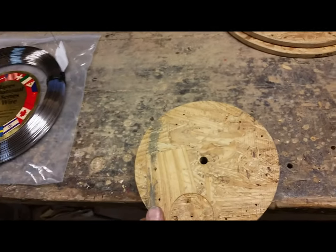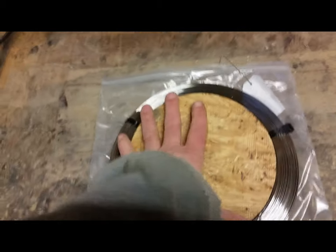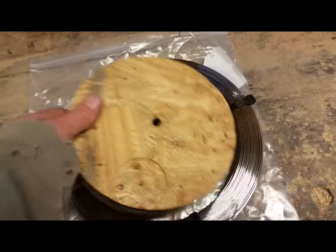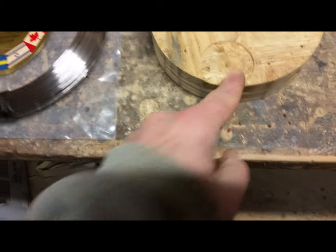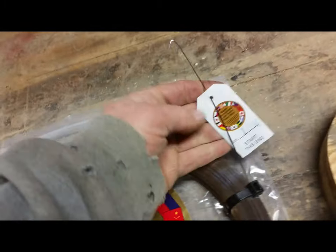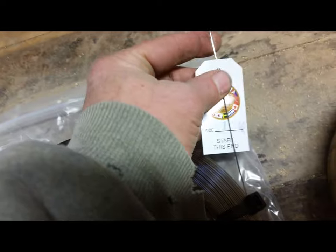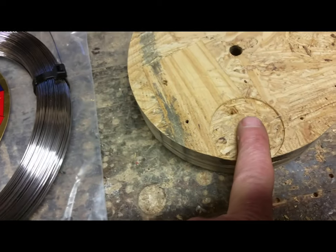The main critical element of a spool that works very well is the inside diameter has to match the inside diameter of the coil — that saves a lot of headaches right there. The inside part of the spool is recessed, and the wire comes where it's identified. You start with this end going through the dispenser — the outside of the coil — and right in here is the inside of the coil, which you want attached to the inside of your coil spool.